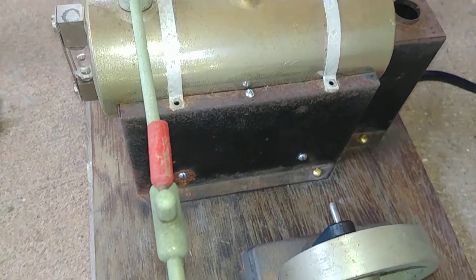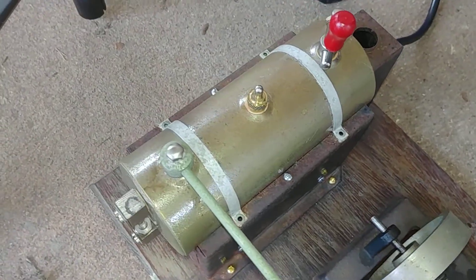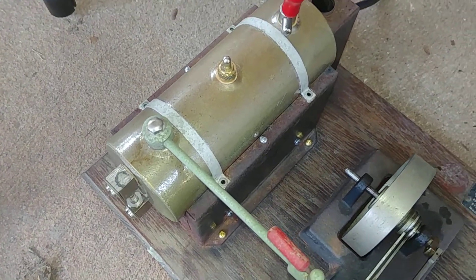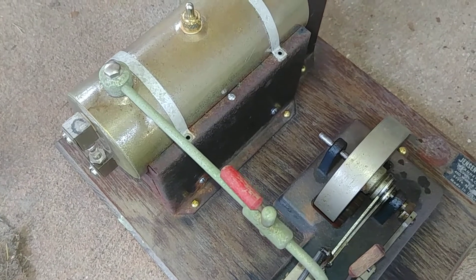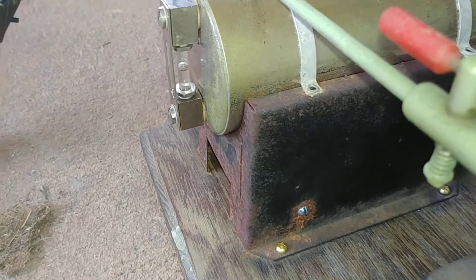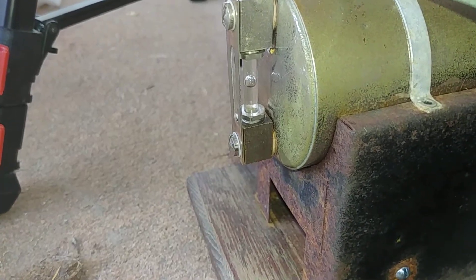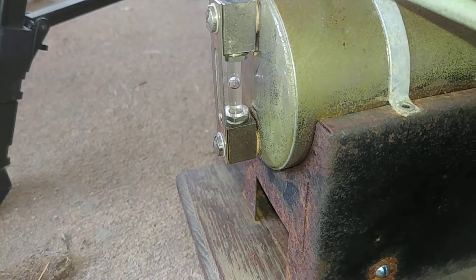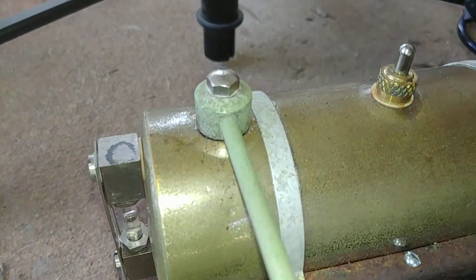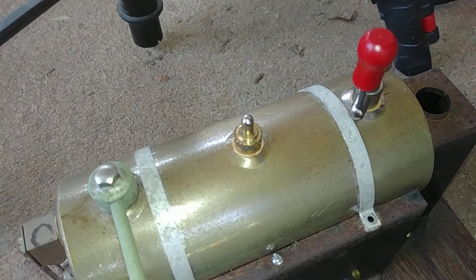The other thing is it has no safety devices on the electric heater. When I got this thing, the electric heater element under here was burnt out. There are no safety devices on it — no high limits. The only thing it has is a sight gauge there, which I was able to restore more or less. And it has a pressure relief valve there. You remove that in order to add water.